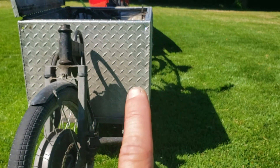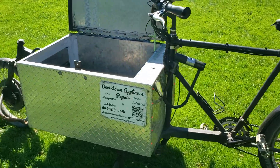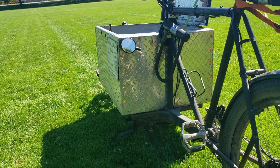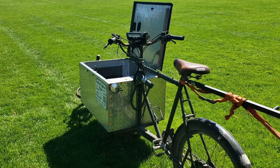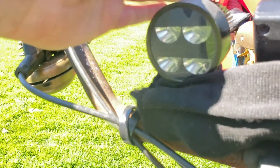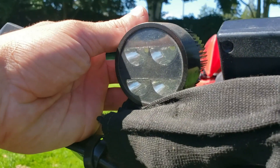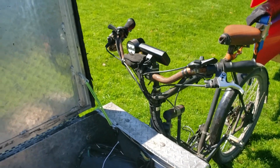I actually power these LEDs — there's a row of LEDs around the right and left sides, front and back. That's critical. Lighting is huge. You've got to make sure you're well lit up because otherwise cars will kill you. There are nice LEDs on the back here — just five millimeter LEDs, but they work great at night. Before I put lights on, I was having close calls with cars. Ever since I put the lights on it's made a huge difference for safety. I've also got a front headlight, probably about five watts, a cheap one off the internet. I 3D printed a little shade for it to keep the light out of fellow bike riders' eyes — it really does cut the top off the beam well. These lights are cheap, like 10 to 20 bucks online, and they work for various voltages with a DC-DC module.